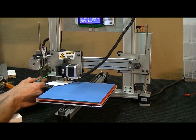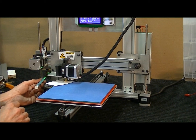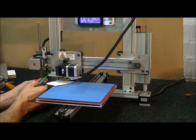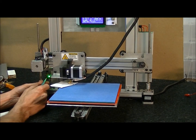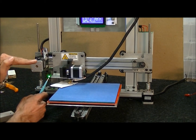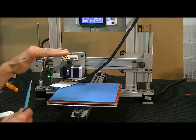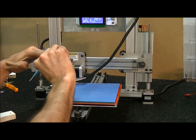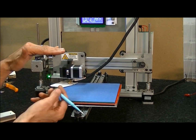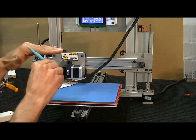I'm going to turn the potentiometer — the little screw on this end stop board. It's the bottom-left screw and it looks like a stainless steel screw. Something to note: there are limits on how much you can turn it. There's a little flat on it, and that flat at the top is the center point. You can go about 100 degrees in either direction, but if you go further than that you're out of its limits and it won't work.